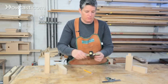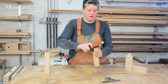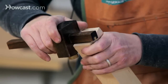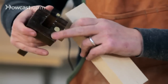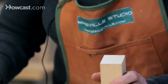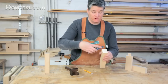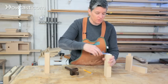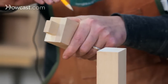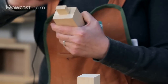There's a lot of eyeballing involved, and whenever you eyeball something in woodworking you always want to test it first on scrap wood. The pins are scribing lines while this face is pressed against the side of the wood — that's what keeps them in the right place. I'm checking that I'm half an inch from the edge and that there's actually half an inch between those scribe lines. For any woodworking joinery, always mark all the way around.